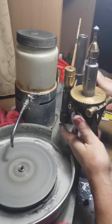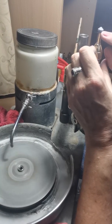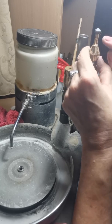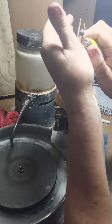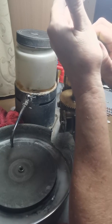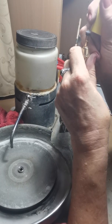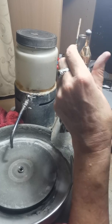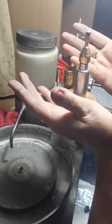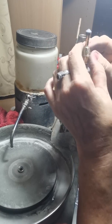I'm just going to move this stone over a little bit. See how we've got this little bit of thin girdle here — I'm going to move it over towards that thin side because here is where it's thin and it's thick everywhere else. We may need a bit more material there, so what I'm going to do is just heat it up until I can see the wax getting soft and move it over just the tiniest bit and push it down. That way when we start grinding again we'll end up with a bit of a thicker girdle there, which will give us enough room for the crown. If you've got a few divots and thin and thick bits, this can come in very handy for maximizing your recovery.